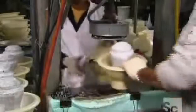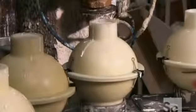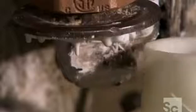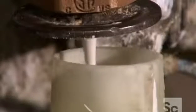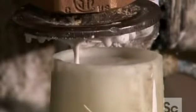After all, they don't want any leaks as they pump it full of plastic. It's a liquid polymer blend. A special chemical in it causes the mix to solidify slowly. It can take days for it to harden around the core, depending on the formulation and type of bowling ball being made.